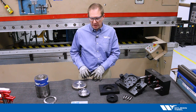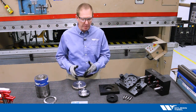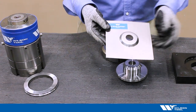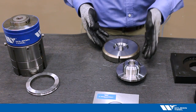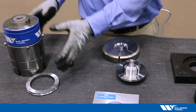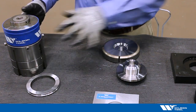In the sheet metal fabrication world there are a lot of situations where forms need to be made in the sheet metal, such as this very simple round emboss, or of course much more complicated forms can also be made. Here's the tool that would be used in a traditional punch press — a simple punch and die — and here's the holder that this tool would go in for the punch press, along with its stripper plate.